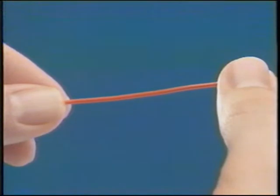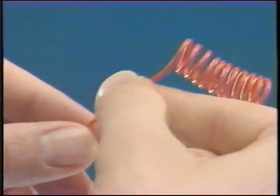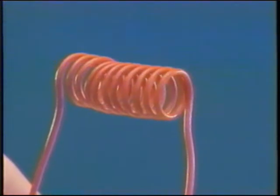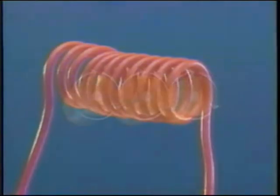Do not attempt to do this experiment without the supervision of your instructor. Electrical current can be potentially dangerous. The magnetic field produced by a small amount of current passing through a straight wire is weak and of little value. The magnetic field produced by a current-carrying conductor can be reinforced or made even stronger if the wire is first wound into a coil.